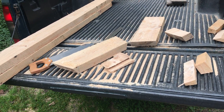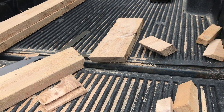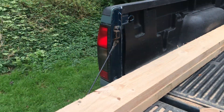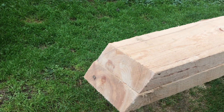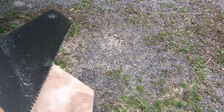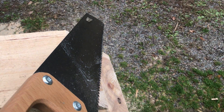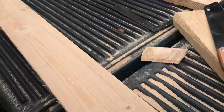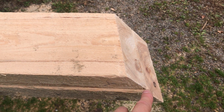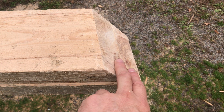After about an hour I finally got my angles the way I wanted them. Now that I have one with the angle on both ends, I'm able to lay it on and handsaw using one as a guide to handsaw the other one off. Once I get the one angle on, I can get a measurement to see from tip to tip what it's supposed to be, and then that tells me where to cut the other side.